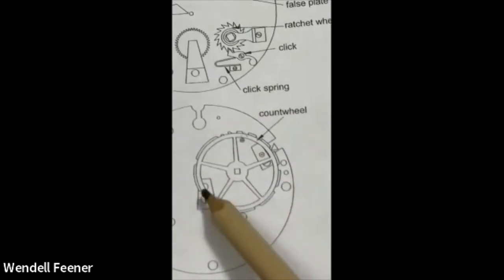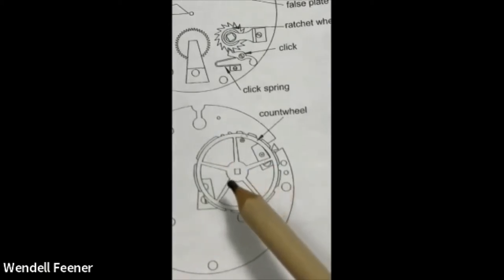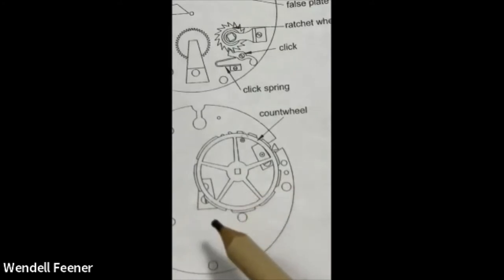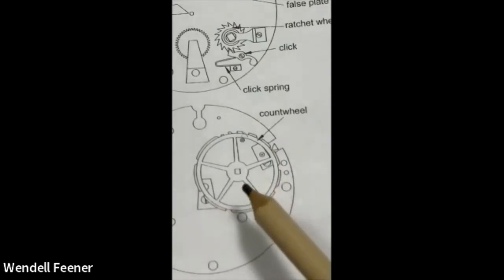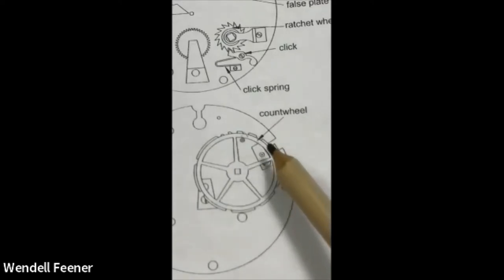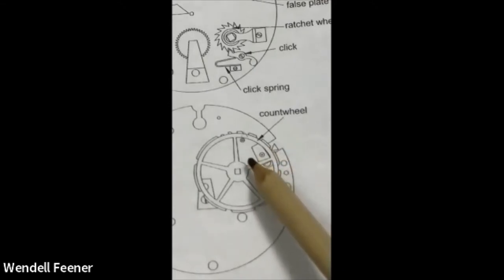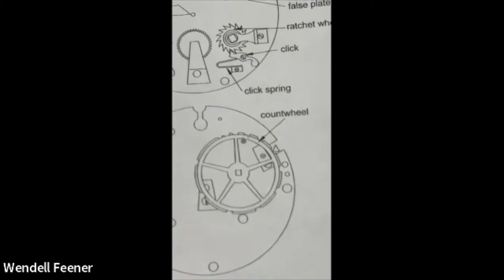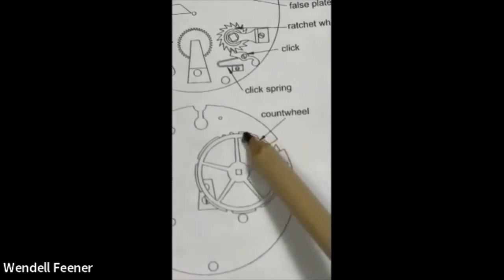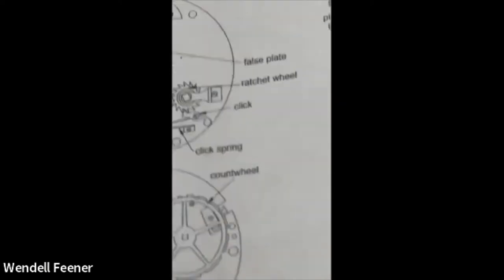This has 12 hollows for the 12 hours. If you ever take one of those off, be very careful because they generally only work well in one of the four spots it can fit — it's a square hole. Try to put it back in the exact same place because there are slight variations. There's a knife edge that follows along the hole and drops over the straight edge — that's when it needs to stop. The hole is big enough that the half-hour strike goes through, and there's a ramp that once started will keep striking for an appropriate time depending on the length of the high spot. They all kind of do the same thing.